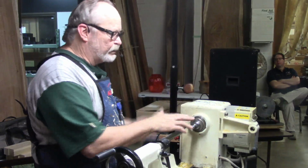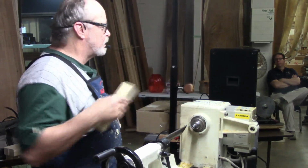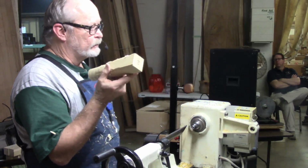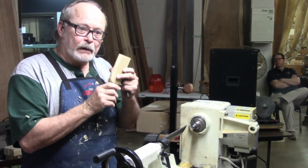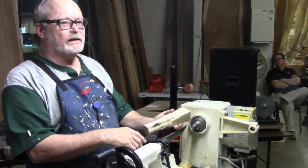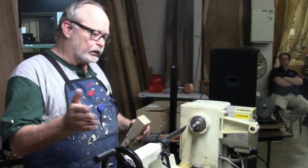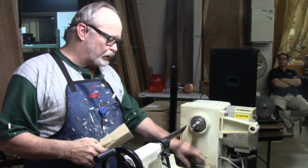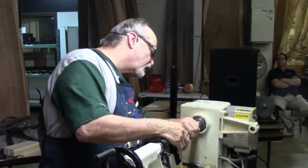But don't think it's just for beginners. It's really not. It has other advantages, too. You can take things on and off the lathe, and guess what? It's always centered. And when I turn handles, I turn a lot of handles, I take them off and feel them. I don't just turn them, say, a masterpiece. That's not how it works, folks. You have to size it and feel it. Or I'll do a run of something. And I know you're not production turners, but you can also load and unload with the lathe running.